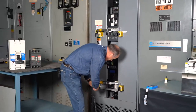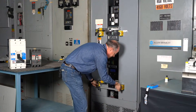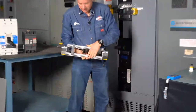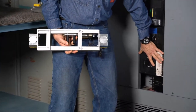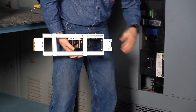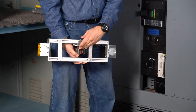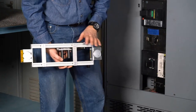You guys showed the underside there. Yes, I will. Let me take this one off. Ben was asking the question, how does this locate? You're going to see that this actually spans this gap and goes flush to the face of the circuit breaker, so that we know the depth that this needs to go and how far off the face of the circuit breaker we can make the throat so the RSA operates properly.